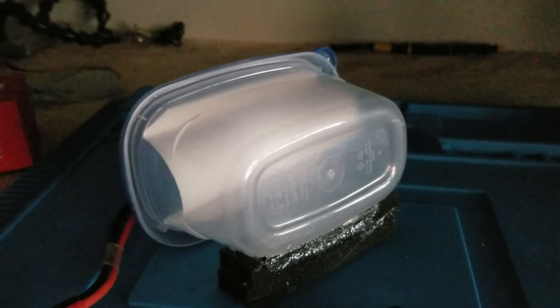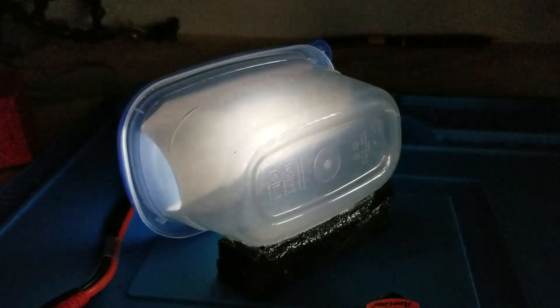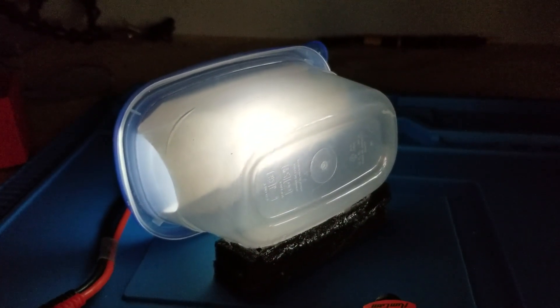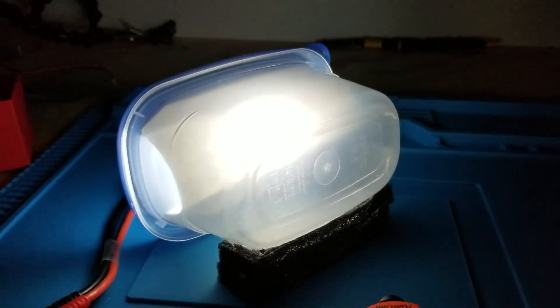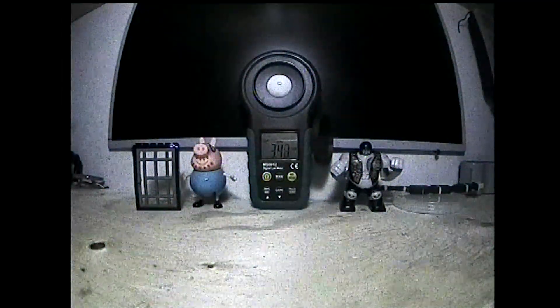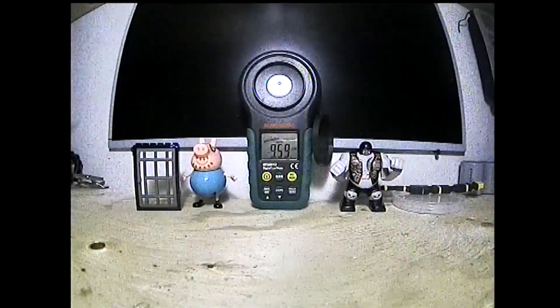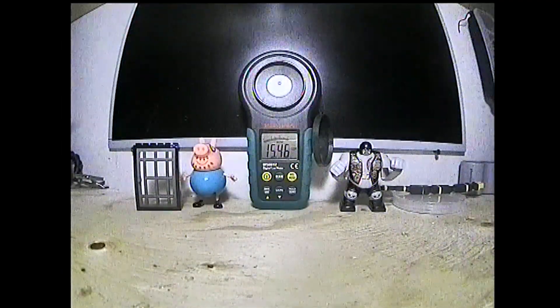I have constructed a double-diffused LED fixture connected to my bench power supply, with an incredible range allowing brightness changes in 10mV input increments. We will use this to test how much light is required for a surface to be visible from the camera, measured with a digital lux meter. At 0.3 lux — the equivalent of a full moon — you can barely make out the number on the meter. At 1 lux, the image is fairly clear and the ISO noise is much less than the previous version, though with a slight blue tint that goes away at about 2.4 lux. Comparing to the V3, while the noise is less at lower light as advertised, you can actually see far less below 2.5 lux. This is probably why Foxeer includes a day and night mode in the settings — and this was day mode.